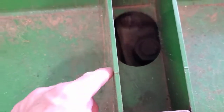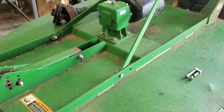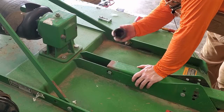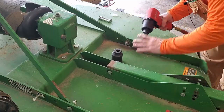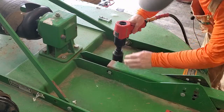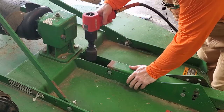The way you do that is through this access hole here. If you can see down in there, there's a big nut and you take that nut off and your blade comes out. So to get that big nut off down there, I've got a 42-millimeter socket. It's a three-quarter socket but I only have a half-inch drive impact wrench, so I've got a three-quarter to half-inch adapter. It'll put everything together. And I'm hoping this is going to come off without a whole lot of effort.